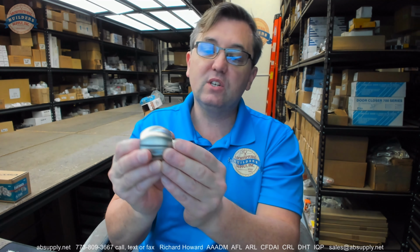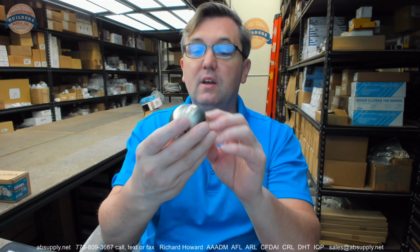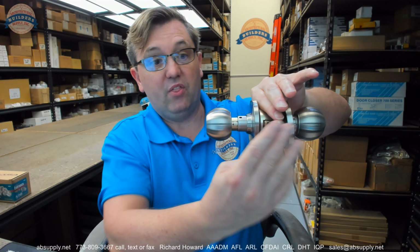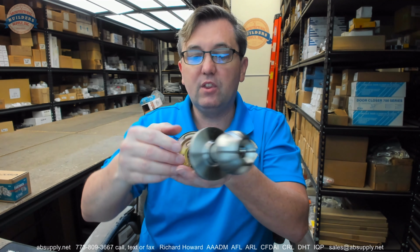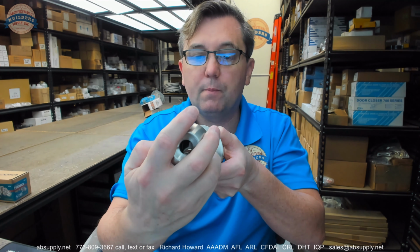So at this point, we need to get the inner rose off the back of the knob to rotate the... Well, actually, at this point, if all we're doing is rotating the handing of the lock, we don't need to do anything other than it was set up this way before we took it apart. Teeth are up. The retracting hub is on this side, so this would work very well for a left-hand door. This would work very well for a right-hand reverse door. But if you had an application where you needed the retracting hub to be on the other side, well, now you need to take that off and turn it over and move it back.